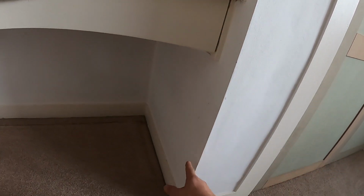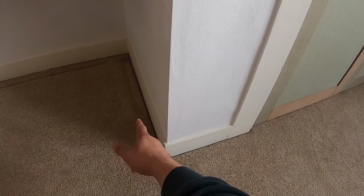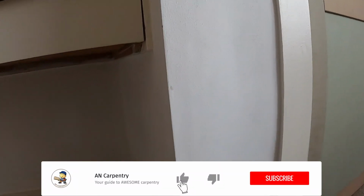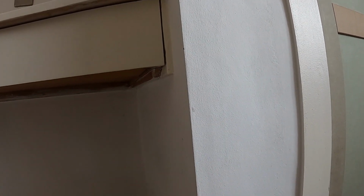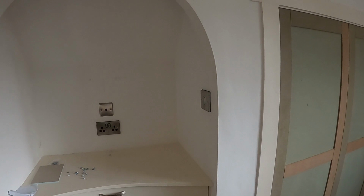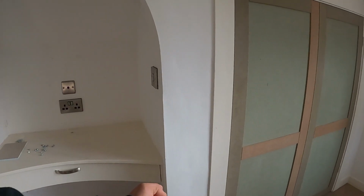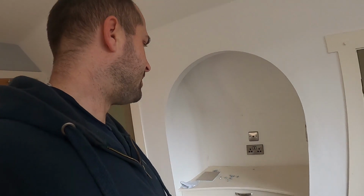So also we're going to have to make end panels, if you like, and the reason being, first of all, you've got a skirting there to get over, and secondly, when you open your doors, if you go too tight and the walls aren't perfect, you would struggle to open them. And thirdly, when you make your unit, if the walls aren't level, which 90% are not level, you're going to have big gaps on the sides, because obviously your unit will have to be square for your doors and everything else, but the walls won't be, so obviously we'll create the gap.